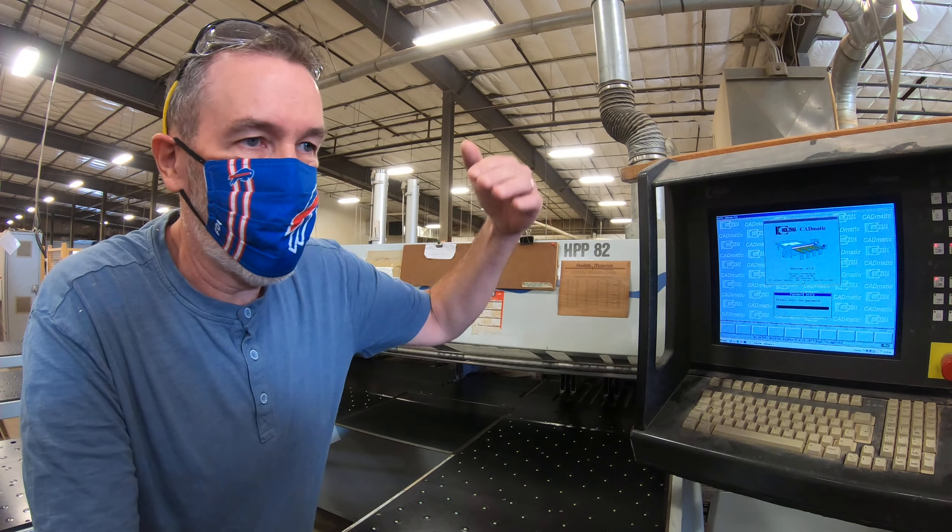Now if they come just to start, we'll go through this. There's a bunch of buttons here — we'll only do the ones that are pertinent to us. This light that's lit up here, that's the main saw. Right now the machine's running, but I just shut the main saw off. That way if somebody was doing a program and they didn't want the saw buzzing, they could set something up without hearing the saw going and still have the machine fired up.